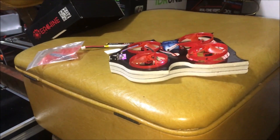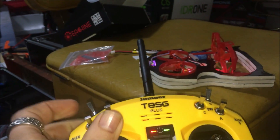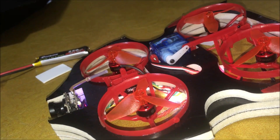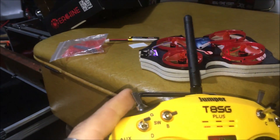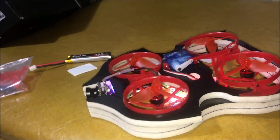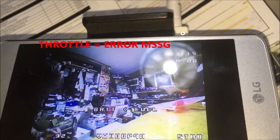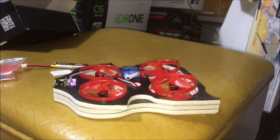Once you're bound, you want to go ahead and set channels five and six. That'll control the servo. On the Jumper I have channel five set up here, and it does do something on there. It shows throttle when I hit that, and when I hit this down it just shows battery full. So I don't know what the throttle is — probably going to have to go into Betaflight and slide a slider over or something. But again, we're going to hit this one that'll control that servo.